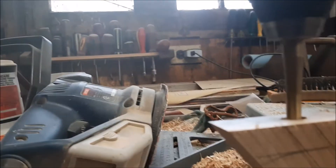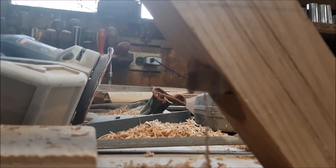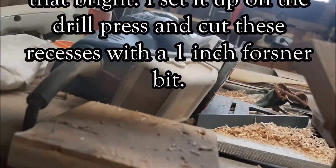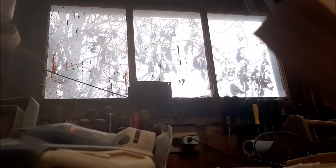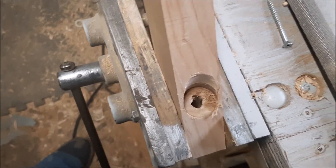Okay, we got it going this time. So I'm trying to put a flat surface down in there to put a washer and a bolt — or a nut to go through — up through where that is protruding. This is a bit like a Forstner bit, but it claims it'll cut both ways. So I'm hoping that without too much more effort it'll cut a relatively flat bottom in there for the nut, or the bolt with the washer on it. I hope it makes sense. I can't say I'm real happy with it, but I can't say I'm horribly disappointed either. I think it might work, though it's a lot of hard work getting that in there.